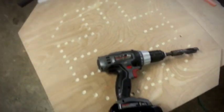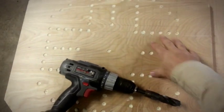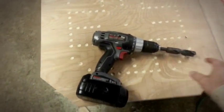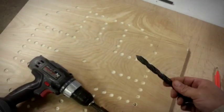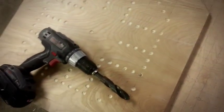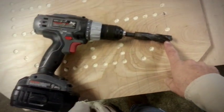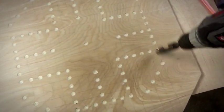We got all those drilled out and fixed. Been real careful — that drill bit will start sinking real quick on you. I got a couple of them that was too deep, but nothing major. After using this half-inch drill bit and making our holes here, we're going to take a seven-eighths drill bit and just hit the outer rim just slightly.